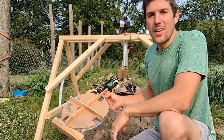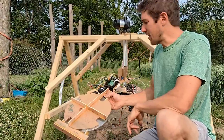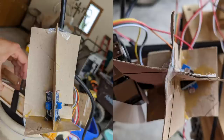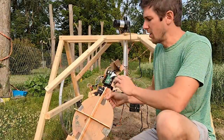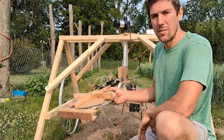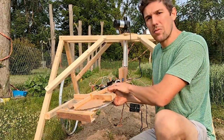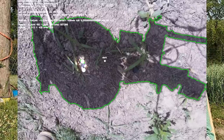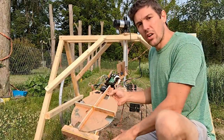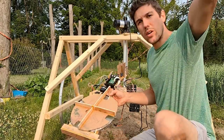When the robot powers on, it runs a Python program whose only job is to find and destroy weeds. The first thing it does is use this sun tracker to get generally oriented towards the sun. Inside each of these quadrants is a photoresistor, and it uses whether or not it's in the sun to decide if this thing is pointed toward the sun. After that, it goes into a fine adjust mode, where it uses the camera on the bottom of this assembly and the light that passes through our lid to find the projection of the sun onto the ground and then center that in the middle of the image. That way we know that this lens is directly oriented towards the sun.